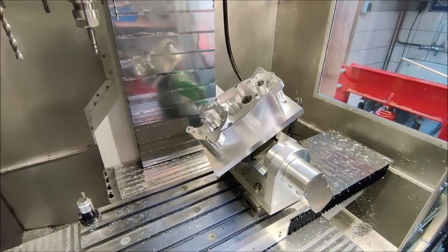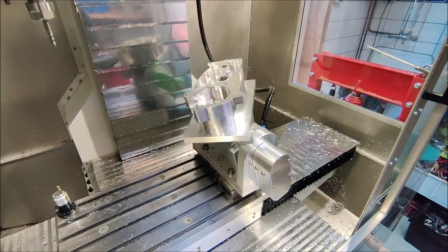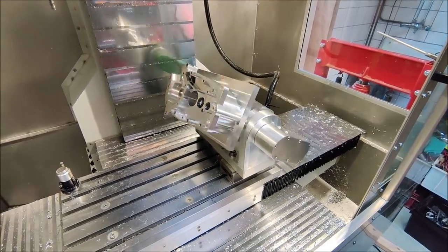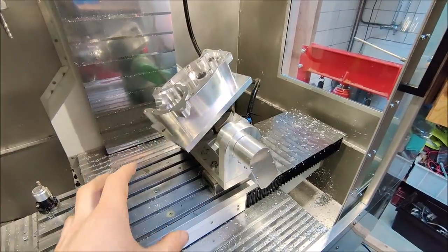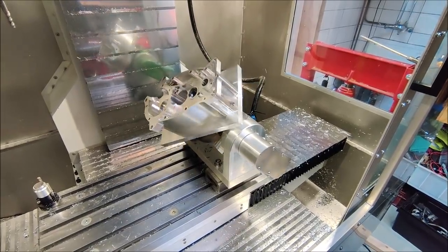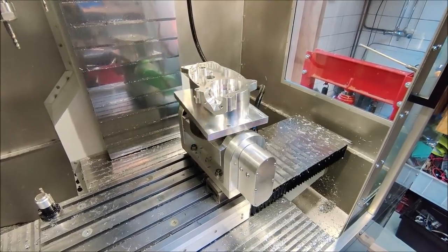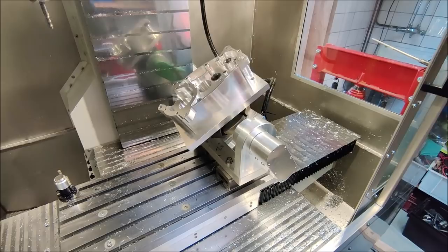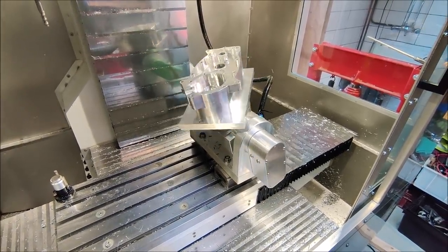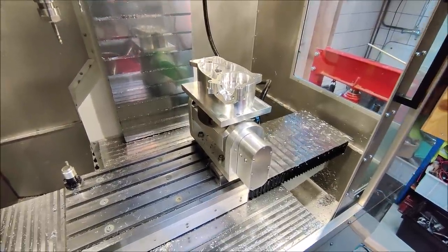This is just a small program to rotate the part. So now with the trunnion I can position the part in the right way so I can drill the two oil channels. And from this setup I can also drill the oil drain plug on the bottom, all in one setup. And from this position, I can instantly mount the next part on it without resetting work coordinate systems.